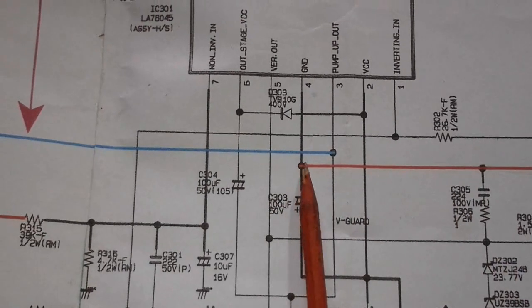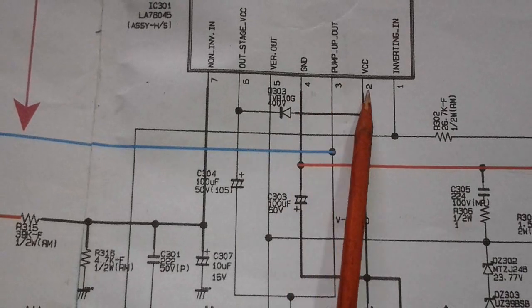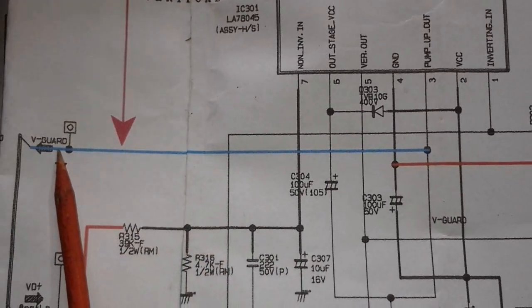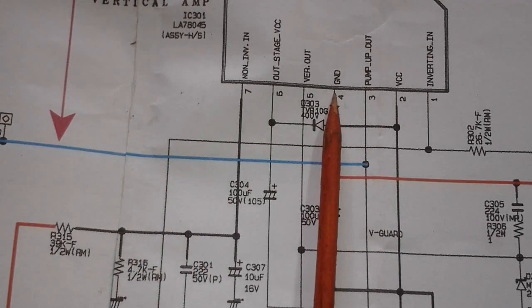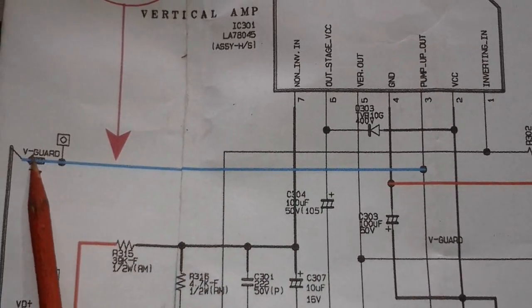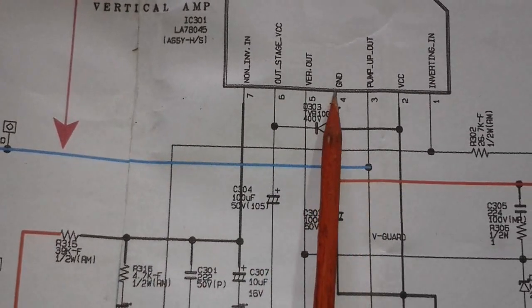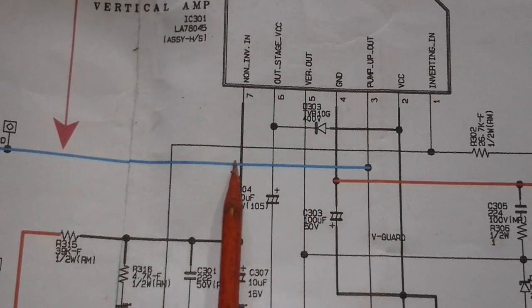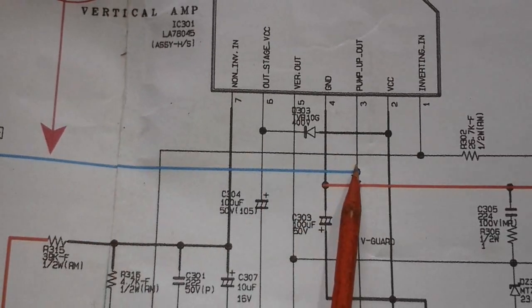In the schematic, this is why the negative voltage has a lower reading — because it is shorted through pin 3, which is the protection. That is probably why the protection is not triggering. The negative voltage is going to the microcontroller through pin 3, which is the protection input — the vertical protection guardian. The voltage on pin 4 is shorted to pin 3, so it is acting as if the vertical circuit is functioning at the micro.